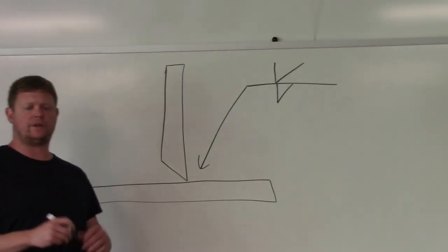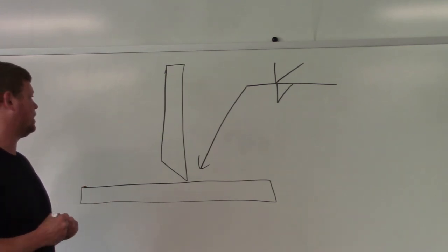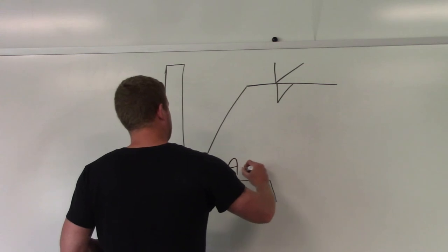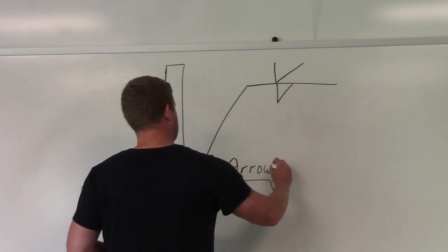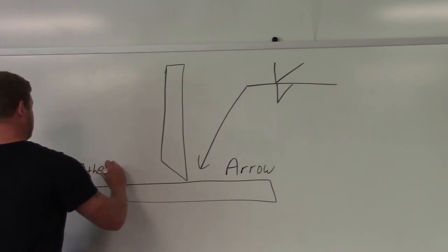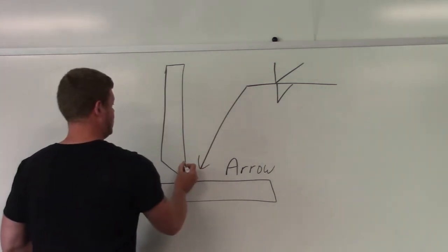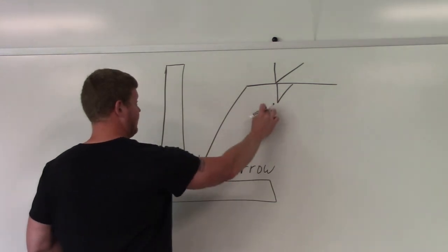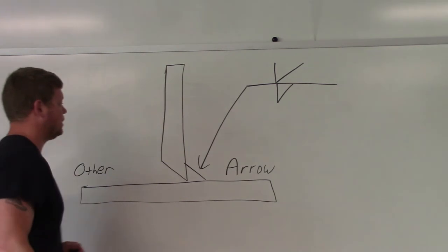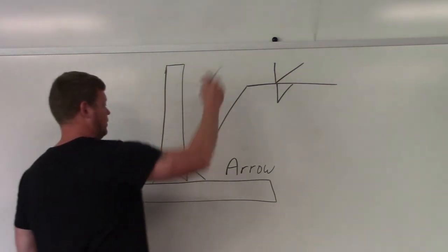One last joint, and I tried to make something a little bit weird. Which side is the arrow side, which side is the other side? This is going to be the arrow side here, and on this T-joint this is going to be the other side over here. The fillet weld symbol is on the bottom of the reference line, so that goes on the arrow side at the top. There's a single bevel on top of the reference line, so that goes on the other side.